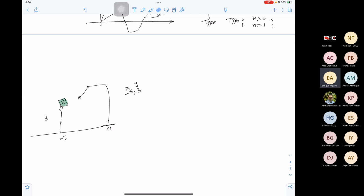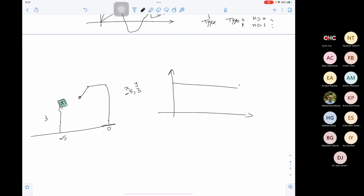The stationary one. Compare this to it oscillating following a sine wave. Compare this even to a straight line. So if you rank them from easy to harder, the easiest will be a fixed point or a constant reference. The second one will be a linear reference. The third one will be a sinusoidal or a parabolic reference. Does this make sense? Why are we trying to keep our reference as a constant value versus time?